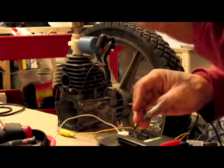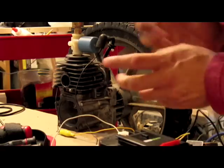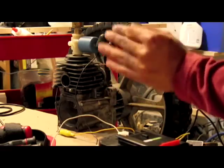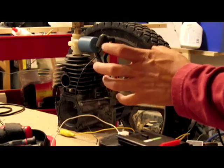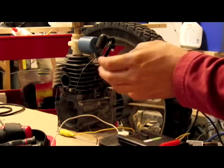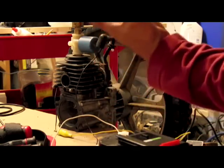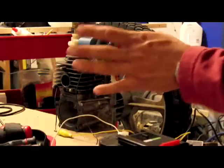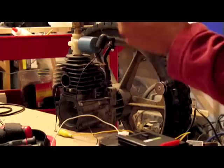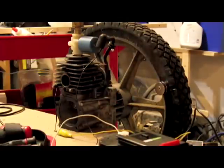To make something that runs a long time, you would probably need to add a slide valve, but the difference between the slide valve of an engine like this and one for a regular steam engine is you only need to allow the air to come in — it's going to exhaust all by itself. This is a lot more efficient than a regular steam engine because regular steam engines need to let the steam come in and then also open up a hole to allow the steam to squirt out through that tiny hole. There's a lot of force on an engine, even a double-acting steam engine, as the steam escapes the opposite side — it's basically force working against you. With this, the compressed air just escapes out the exhaust as it normally would, and you don't have that force going back up.